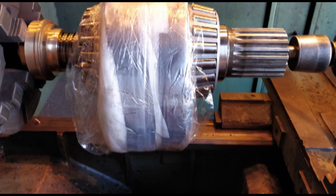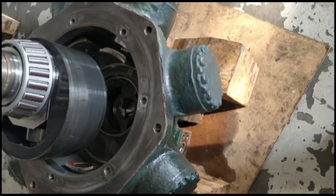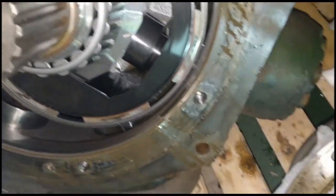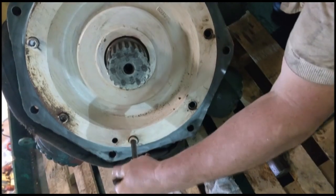In this case the shaft seal was found leaking, hence the shaft was polished at the sealing surface. The drum was secured with wooden pieces. Place the shaft carefully, matching markings with the Oldham coupling. Secure the pistons to the shaft with bottom and top con rod retaining rings, and fix the end cover.